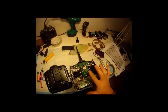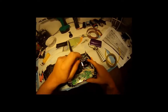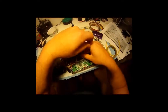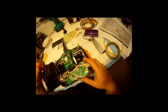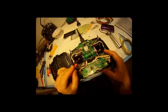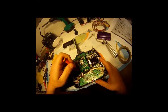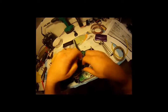What we've got to do is carefully take the transmitter — the TX board for the modulator — and remove those four screws carefully. You want to be careful because some of these are soldered onto the board and some are just plugged in, so you've got to be really careful not to strain those wires. We'll just take that off.